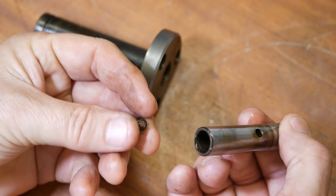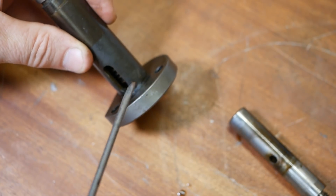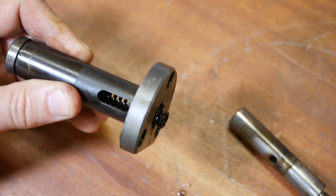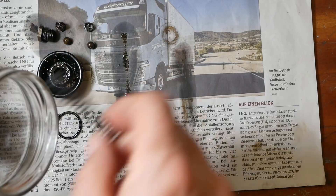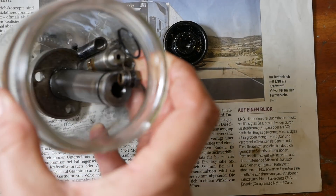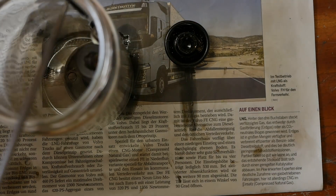Once again we've got a fine spring and a ball. Then here in the main body, another spring with a washer on the end of it. I'll load all this stuff into a jar and give it a good ultrasonic cleaning. I don't think there's any brass in this lot — it's all steel or iron, so I can do all of that with sodium hydroxide.